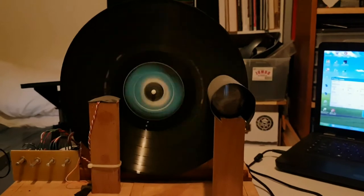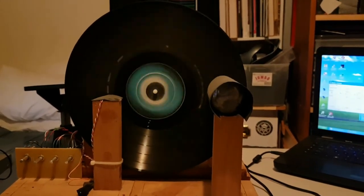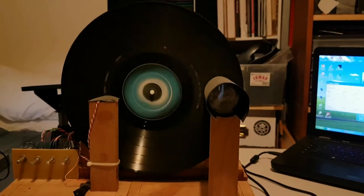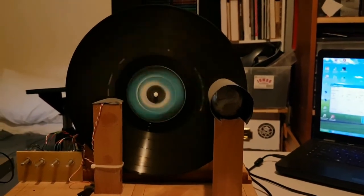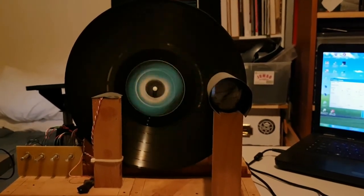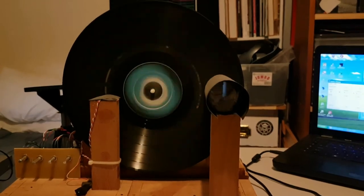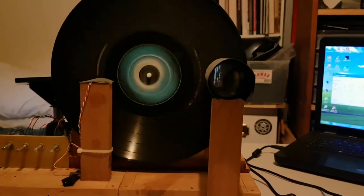That's synchronized. I know in the early 2010s I was experimenting with Nipkow receivers, and none of them were synchronized. They were all totally manually adjusted: you adjust the motor speed and hand brake the disc to get the picture synchronized. It was a lot of fun, I have to say.